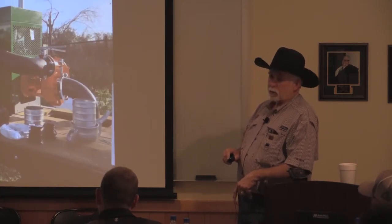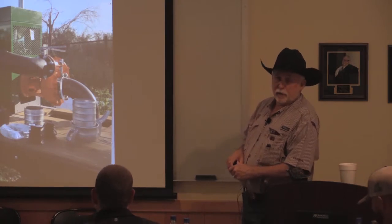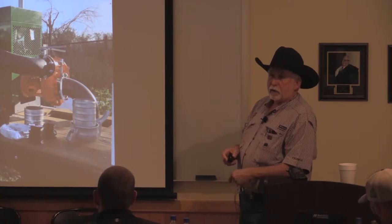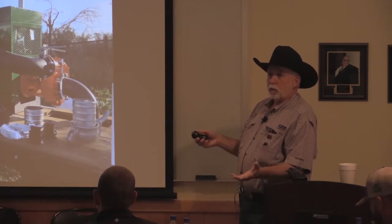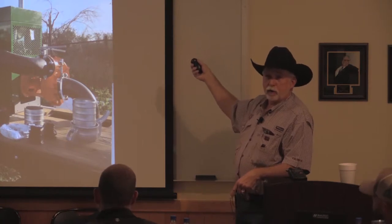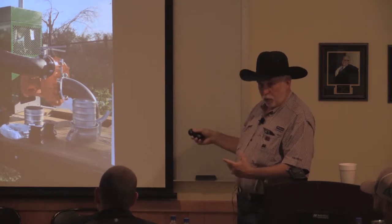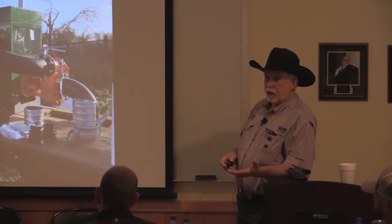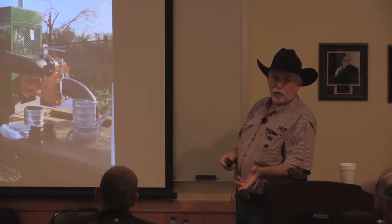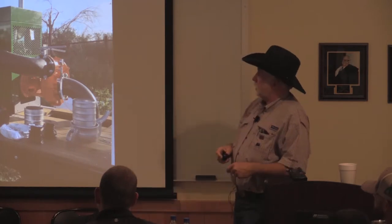And then they used to build these on trailers in the valley using those media tanks. The trouble is when your water quality gets bad in a hurry, and it does, that's typical down there, because the water will be clean for weeks and all of a sudden you get a rainfall event and they start letting more water out of Falcon. Well, when they increase that flow down the river, now you get all that silt and stuff coming down, and it was slamming the media filters shut because they take so long to flush. This one flushes in a minute.